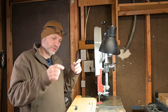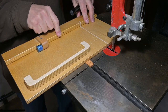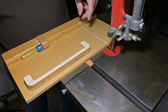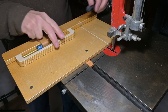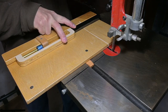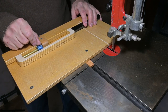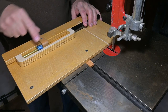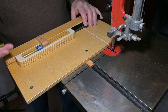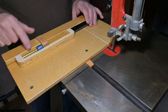We're gonna cut this down. We're gonna use this jig for the tubes on the Kojent pen. So this is the sled my dad made. Nice little jig. You take your tube, whatever you want to cut, whatever length you want. Take the gauge, put it there, and then you put your blank here. It will cut the blank the same size as that tube, or in this case, with that fine tuning adjustment knob out the way that it is, it's gonna make my blank a little bit longer than the tube, which is what I want in case I have blowout when I drill a hole to put the tube in. So I'm gonna do this one first, and then this one a little bit shorter than that one.